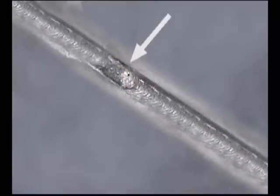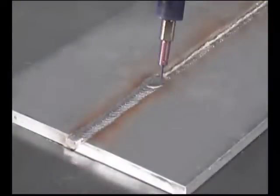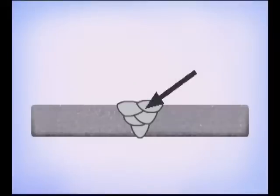Anytime you weld in a bevel, you want the filler metal buildup uniform. If there's high spots from stopping and starting, use a grinder up on edge to even up the weld. Depending on the metal thickness, you may be able to finish in one more pass. With the gun angled and a slower travel speed, build up weld slightly wider than the bevel and above flush with the surface. For heavier metal, run as many beads as it takes. Clean the joint after each pass and overlap the edges of the weld beads to avoid trapping slag.